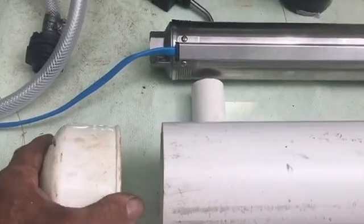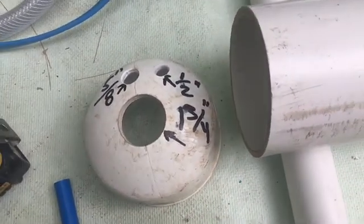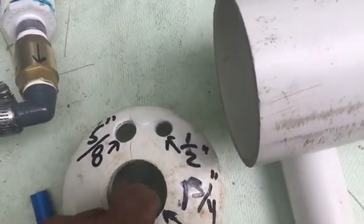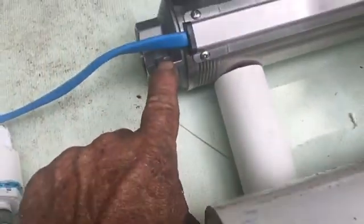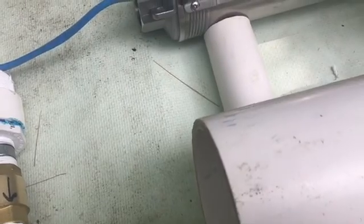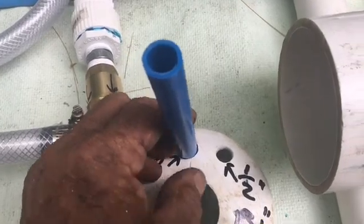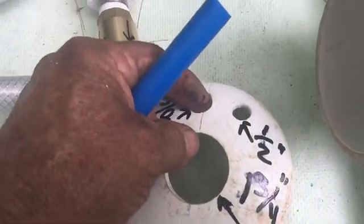On the lid there is a one and three quarter inch hole so that the inch and a quarter adapter from the pump will go in just like that. There's a five-eighths hole for where the wire will come out. There's a half-inch hole for the pull cord attached to the motor. I make the wire hole five-eighths because I put a short piece of PEX pipe in it, and the wire will come through it to protect it from ever getting rubbed or cut on the edge.